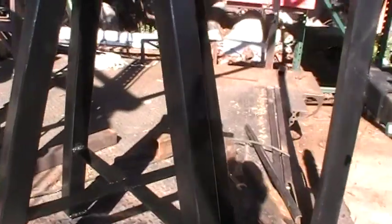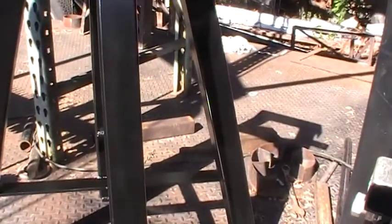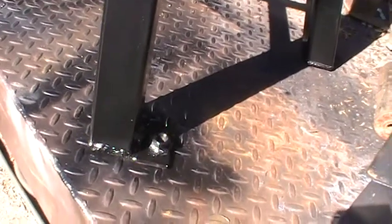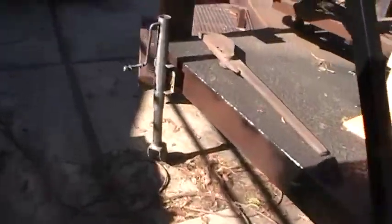I like four legs splayed out at each corner, and the reason for that is more stability. Now, on different surfaces all four legs aren't going to touch the ground. So what I did to mitigate that was put a half-inch nut welded on — and I only did it on two legs, this one and this one. Because if it's going to go, it'll go this way or this way, so you only need to lift one leg.